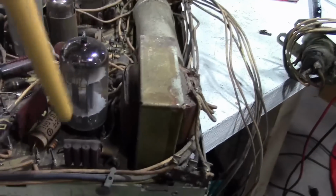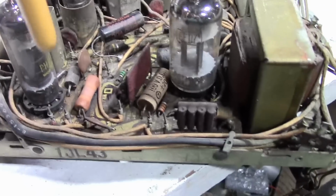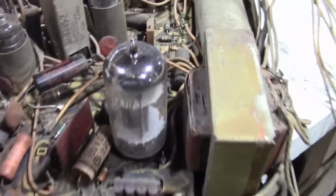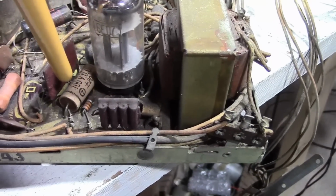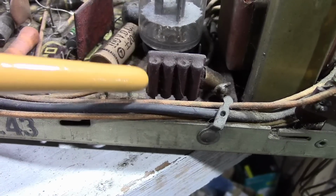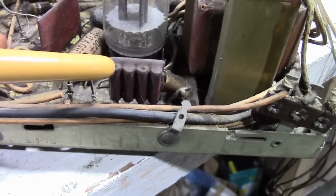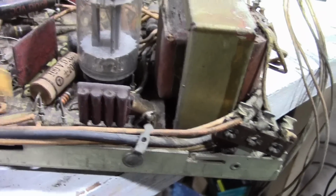The other dreaded thing about these sets, the couplates. In order to make these more compact and to streamline production, they made use of about half a dozen of these couplates. What are these? Multiple components on one subassembly. Pretty easy to see on this. There's 4 parts in there. Either tubular ceramic type capacitors or resistors on a substrate connected together, and then there's little wires coming up from below into the circuit board.